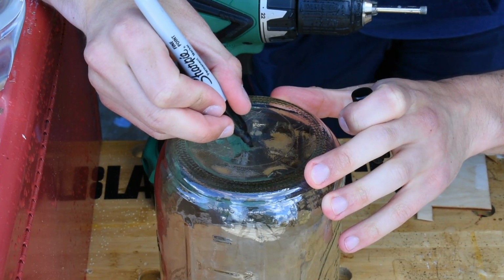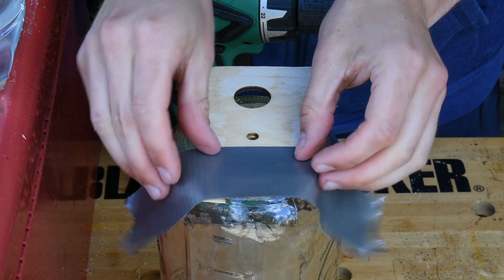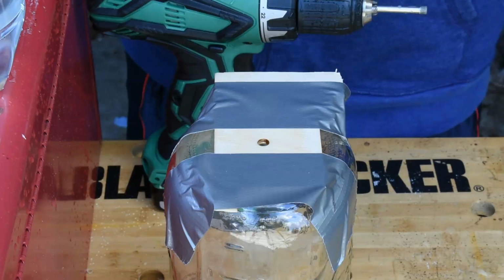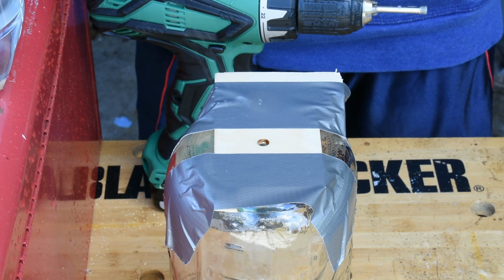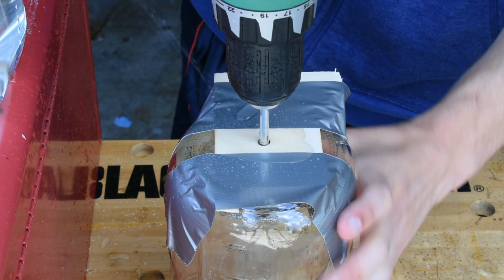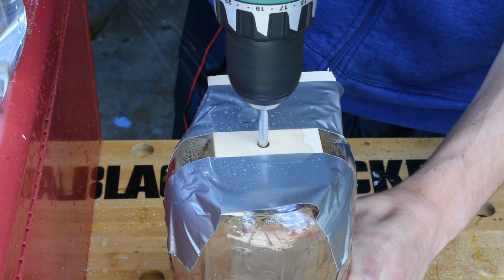To do the cutting, I marked the rough center in Sharpie, then taped the holes over the center mark, started the water, and cut through the glass. The basic process for cutting is to put very little weight onto the drill and rotate the drill slightly during cutting.